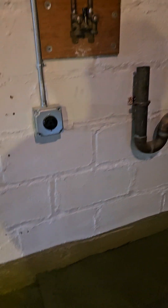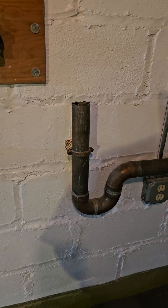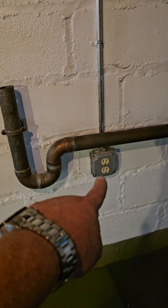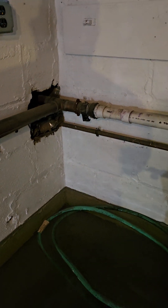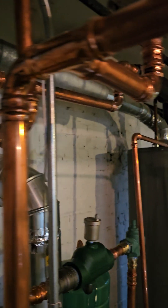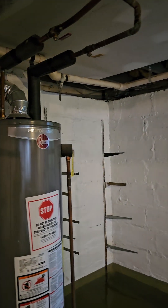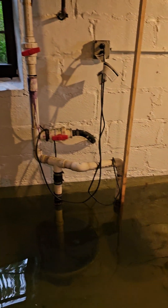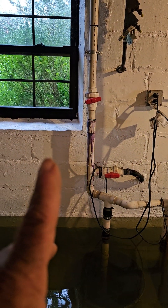I'm here to take care of the water issue that somebody else didn't take care of. They hired a waterproofing contractor that came in and installed these sump pumps. This is a drain where the laundry system is supposed to be — that's for the washer, that plug is for the dryer, and that should be a GFCI outlet, not a regular outlet. They connected PVC going across, up, staying in the corner, then up and across.